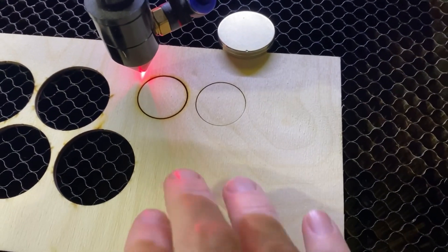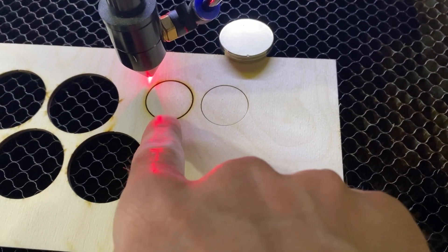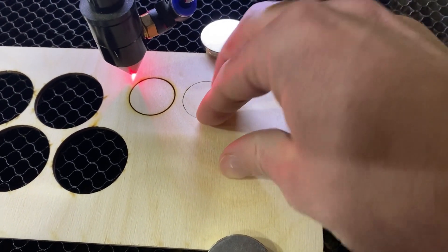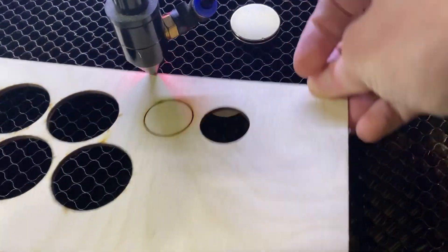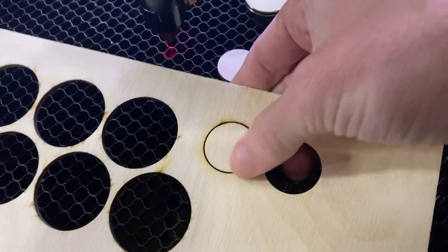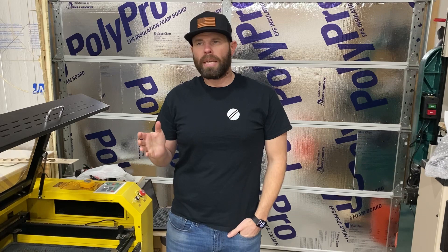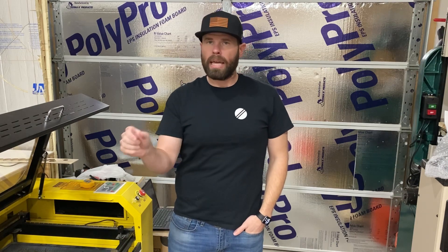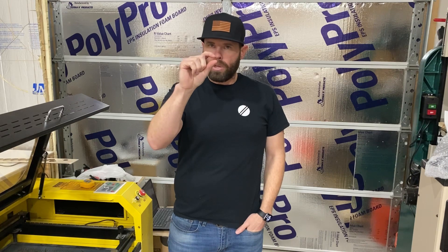To serve as a point of reference, I cut these two circles. This one was cut at the stock height — about 7mm of space between the nozzle and the material, which is the gauge that comes with the machine. This one was after I did my ramp test, and you can even see that this piece is already loose while this one is not. If you have rough lines or you're struggling to get cuts that go all the way through, you need to do a ramp test. Keep in mind, if you're using a lens with a longer focal length, you'll need a larger distance between the nozzle and the material, or a slightly steeper ramp to see the results.